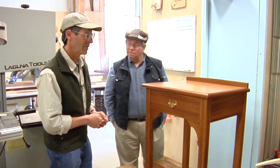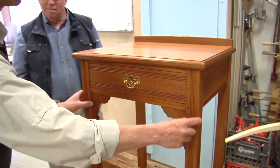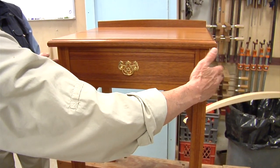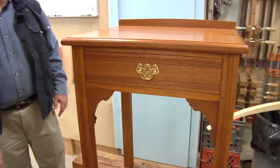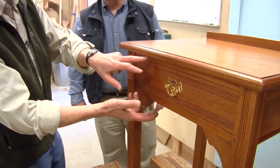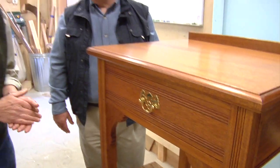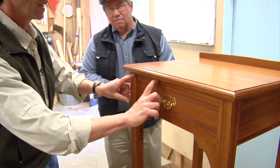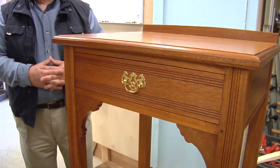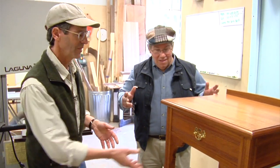So it's a square with another third built on top to create the rectangle — a two-to-three ratio. For the legs, I took the span and took one twelfth of it. For the apron, hearkening back to the famous Grecian columns, the architrave is one-sixth the height of the span on some of them. So that's what I used here — just to see if it would look right. Looks right to me. This apron is one-sixth of the height.